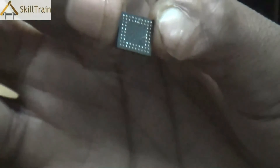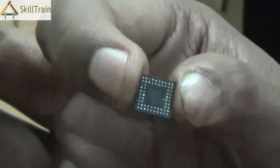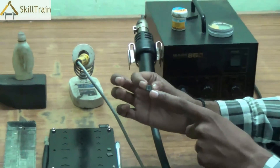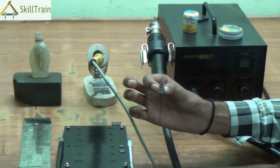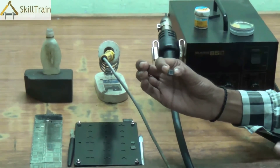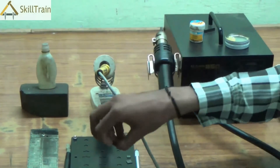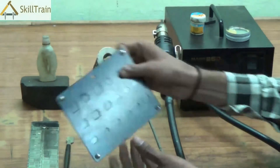These ICs don't have any pins on the side. As you can see, the small minute balls are very clearly visible. These are the points which are actually touching the PCB, and thereby all communication that happens on the IC goes through these small connecting tips. Many times these connecting tips may disappear due to continuous usage or may not have been placed properly. Sometimes they can even break if the mobile falls or is handled inappropriately. So in order to replace these ICs you need to do a process called reballing, through which you can replace these balls at the back.